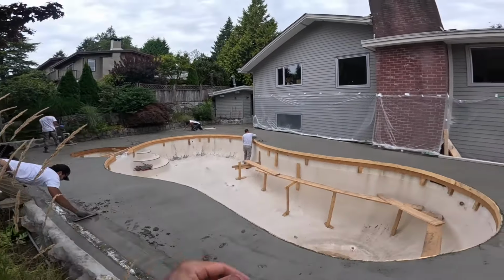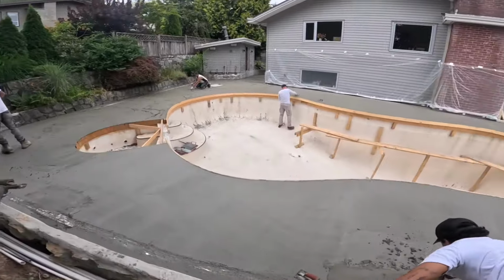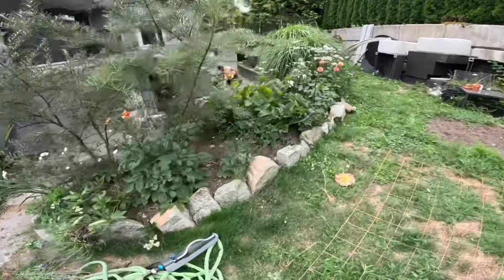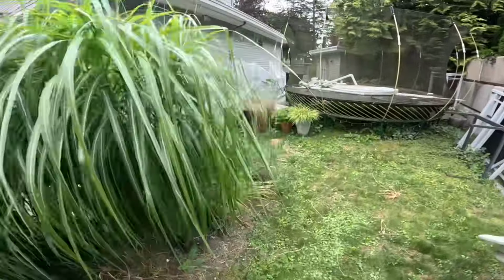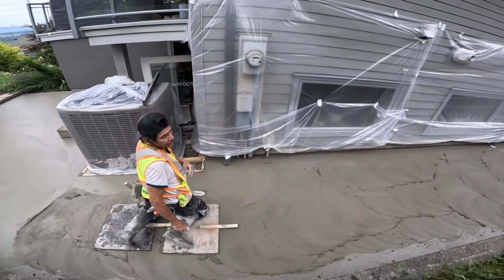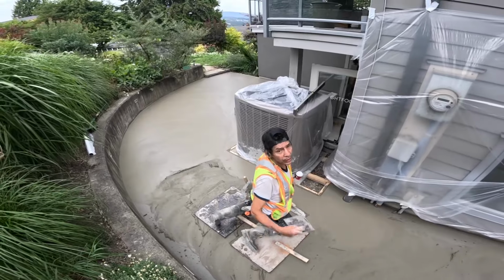There we go. Give her a hand wipe and then finish it out with the sponge trowel. It's a beautiful thing. Wonderful. Don't mind me just sneaking up on you. So hand trowel, then the sponge is the last thing, Raj? Is that how it goes? I should know this by now. Hand trowel and then sponge it? Yeah, we wait till it dries hard enough, and then hit it with a sponge.